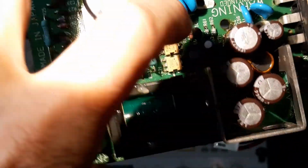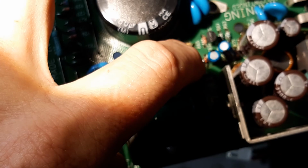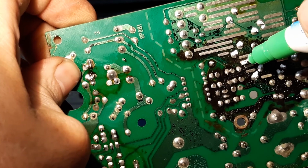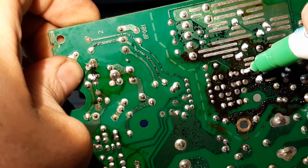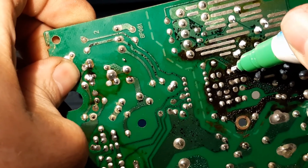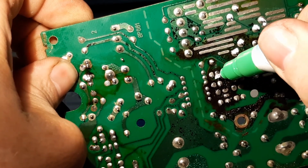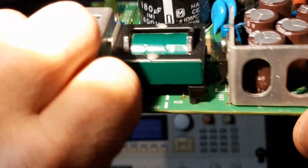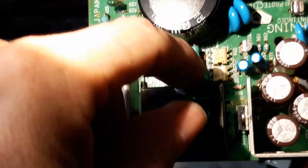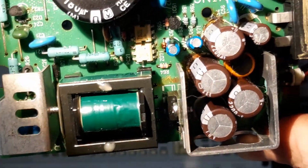There's quite a lot of legs there. So we've got a resistor to the right. We've got the two caps and then another resistor. So we should have 4 in a group, okay? And here we go. That'd be a resistor there, because that's the length of the resistor. That's its legs. Then we've got a pair of terminals here, a pair of terminals here, and then we've got a resistor, and I imagine another resistor. So I see, we've actually got a resistor hiding in there. So you might want to change these guys too. I'm going to give you the values. Let's zoom in.